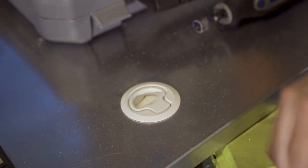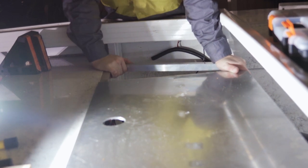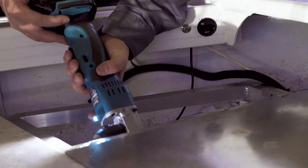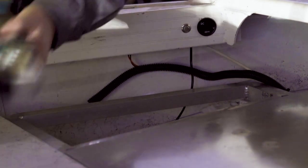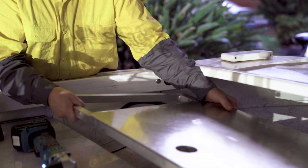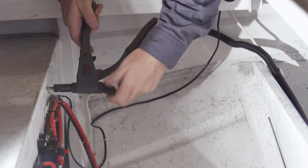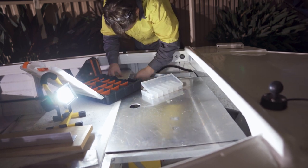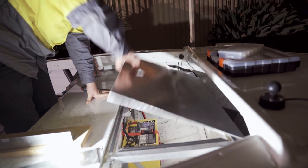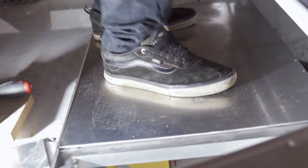The latch is slightly wider than the hole saw and a little finessing is required to get that snug fit. I did need to add a spacer shim on the inside of the latch to keep it nice and secure. The frame is a very snug fit, squeezing nicely between the bulkhead and the bench seat. To secure the frame into place I opted for rivnuts — not only are they convenient to attach and remove, but they also allow thicker hardware as the frame relies on the shear strength of the bolts. With just the outer bolts in place it was time to give the deck its first stand test, though I definitely needed to add a little more hardware through the centre of the frame.